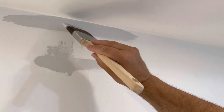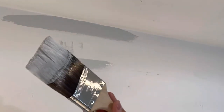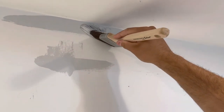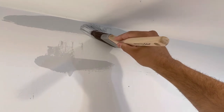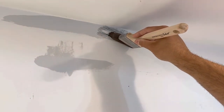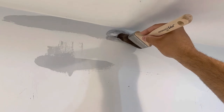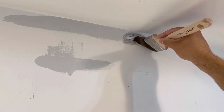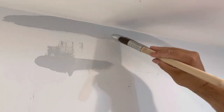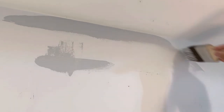As you can see, we did cut to the ceiling there. I'm going to continue forward — I probably have enough paint on the brush to keep going. I press down and fan it out, getting those top couple of bristles to the corner. If you're having trouble making connection at the top corner, you can always apply a little pressure upwards to get those top bristles to hit that corner. Then if you feel uncomfortable you can brush down, and continue working your way across the wall until you reach the end.